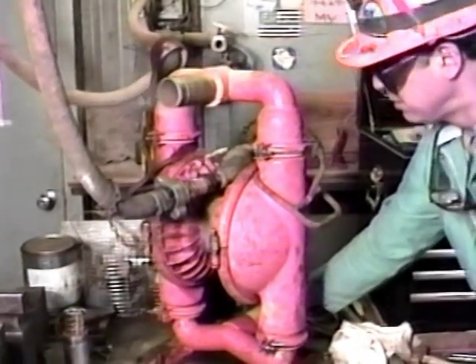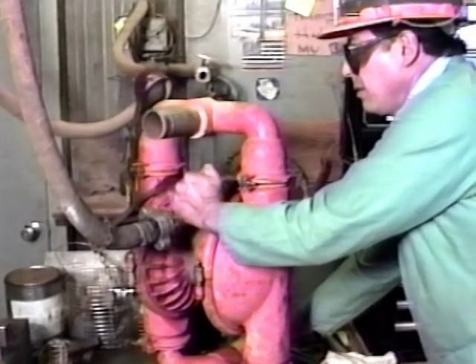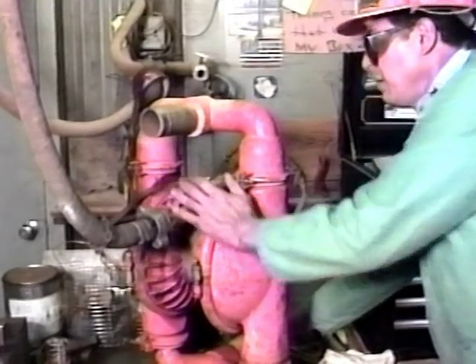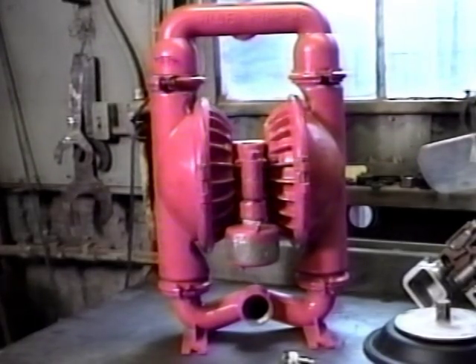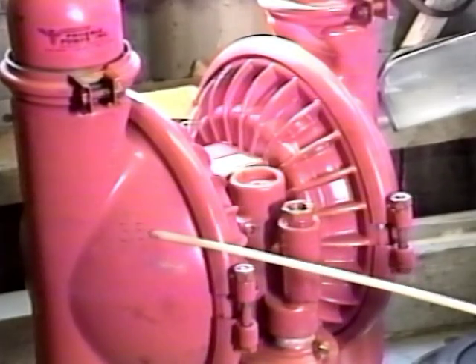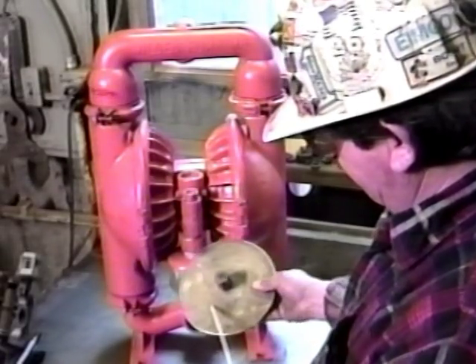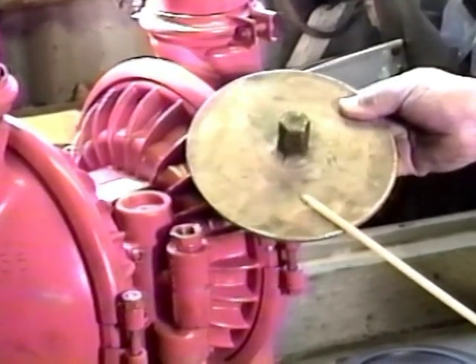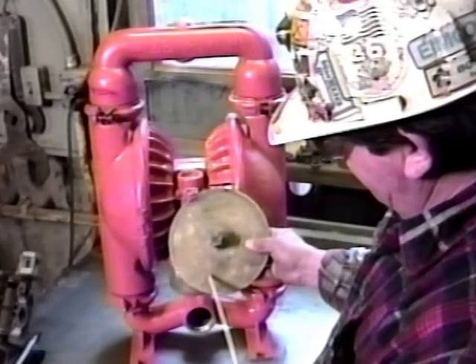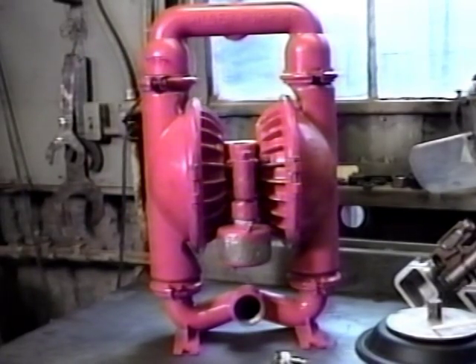A basic understanding of the pump is all that is required for safe and reliable operation. The air-operated double diaphragm pump is made up of two sections: wetted and non-wetted. The wetted section consists of those parts of the pump that come in contact with the liquid. They are the inlet housing, two pumping chambers, discharge housing, and outer diaphragm pistons. These metal parts are constructed of investment cast 316 stainless steel to provide superior performance when handling abrasive and aggressive liquids. The life expectancy of stainless steel is significantly longer than aluminum, cast iron, or plastics in this application.